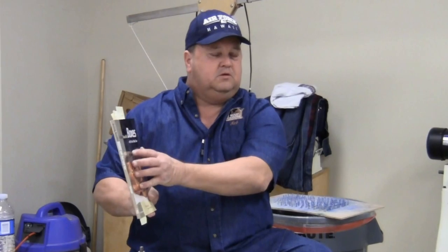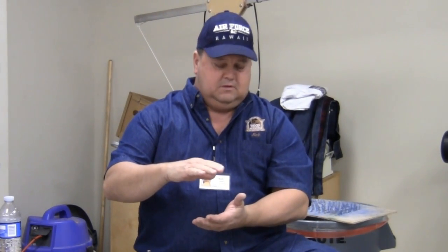I want to start off by selecting the wood that you use for this. If you're using rough cut lumber, you want something about an inch thick and at least about 5 foot long. For any one of the patterns that are in this book, 56 inches is the max that you would need for lumber for making this. You take one board, you get the width of whatever it's going to be, depending on your pattern, and you cut that into 5 different boards, so you end up with a thickness of right around 4 inches or so.